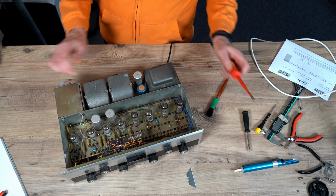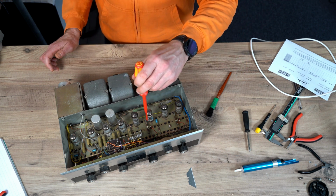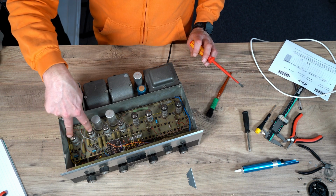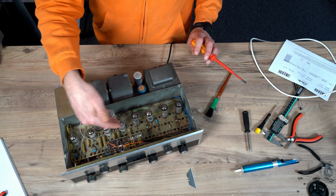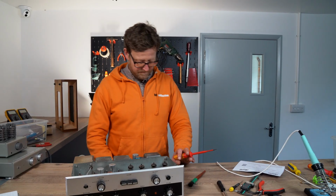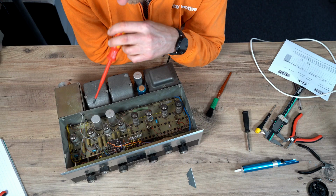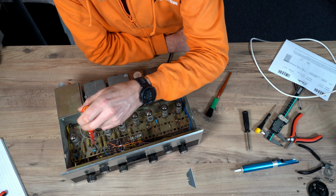Now, I know for sure that these two on the output stage, these two on the output stage, you're going to have a phono stage, probably this one, and then this will be like for the line level phase splitter to feed those. So if you are going to be using the Cadet and using its phono stage, then definitely worth changing the components linked here first.